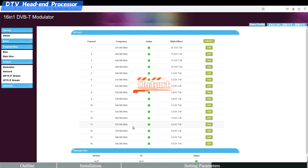For output, this device supports 16 carriers DVB-T as output. This series can support 4, 8, 12, 16, or 24 carriers RF output with different modulation standards like ATSC, ISDB-T, DVB-C, and DVB-T. DVB-T can transmit up to 31.7 Mbps per frequency point. Here, 4 sets of 7M HD programs can be transmitted per frequency point, so 16 carriers can transmit 64 sets of HD programs. If you need more, order the 24-carriers model.